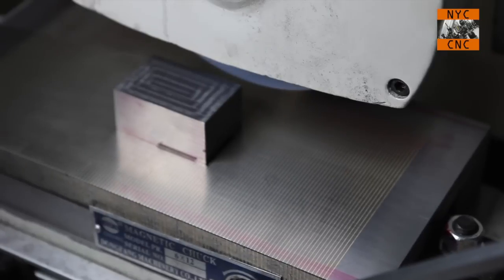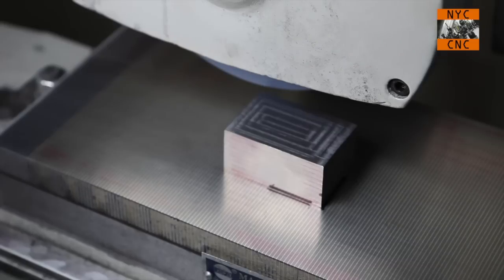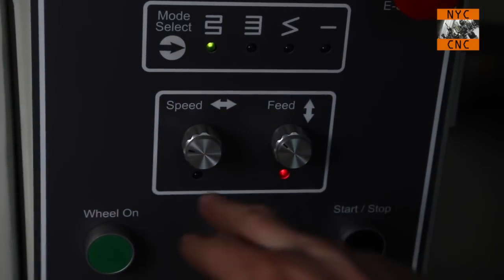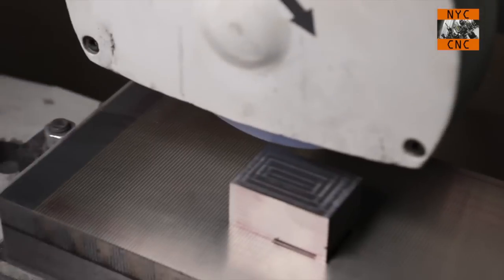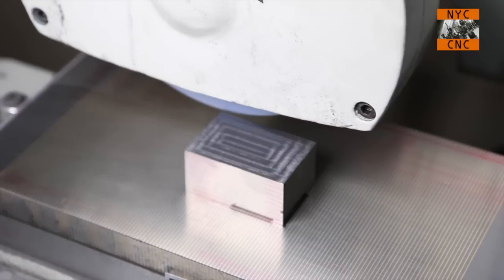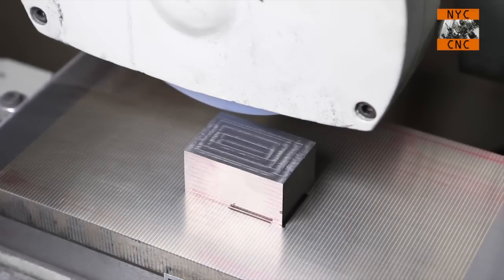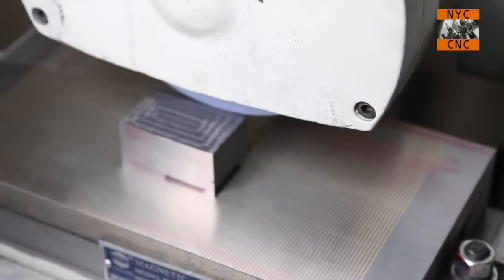Yep, okay. So you have to start within the, you can't have your dots red, so you have to come within the travel limit like so. And now we'll hit the start button, and my guess is we will not really see any sparks. We'll have to come down a thou before we get any actual grinding. Okay, this will be the first pass where it contacts.